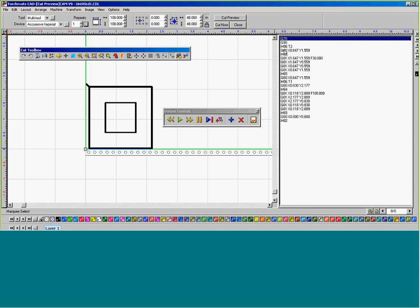to tell you a little bit about G code. As we can see with this M06 right here, it is M06 T2. That means that it's using tool number 2. And we can see that this is our feed, 30. So our tool number 2 is going to go first at 30. This M06 is over to our plasma, and our feed rate is 100. So we know that our sequence is correct because our T2 is first and our T1 is last.